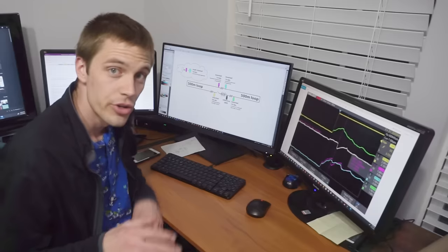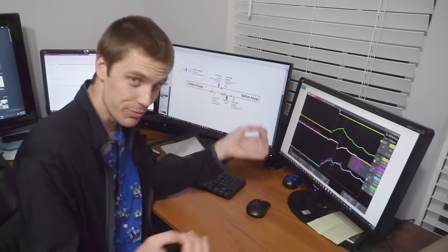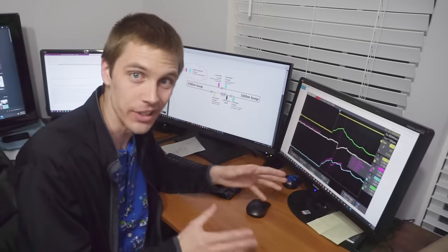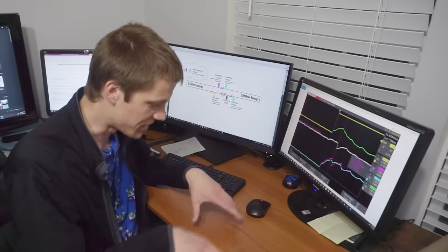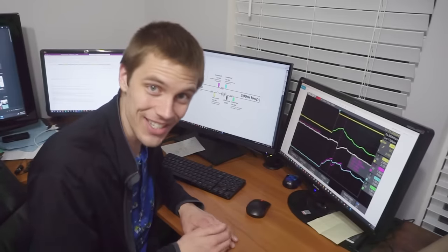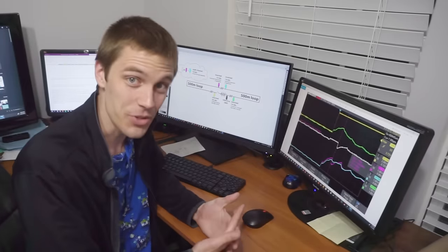That's really cool. So for the first 1.6 microseconds of this circuit being on, it is bound by the laws of relativity to look exactly like the trace from when the wires were fully connected. We have to wait 1.6 microseconds for the oscilloscope and the resistors and all the bits that we're measuring to be able to learn that the end of the wire doesn't exist, and then they start behaving differently. But there's a bunch of stuff that happens after that light speed delay that is really interesting.